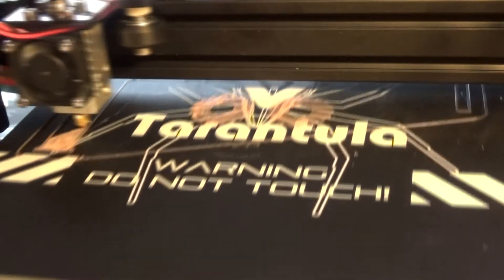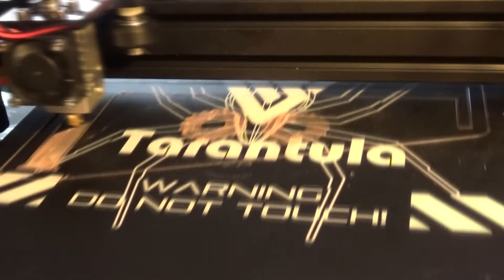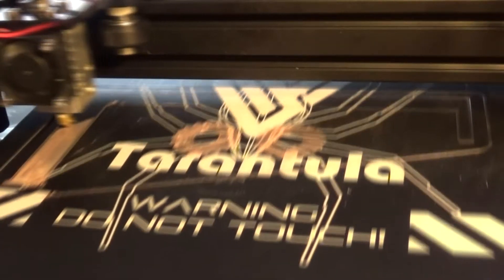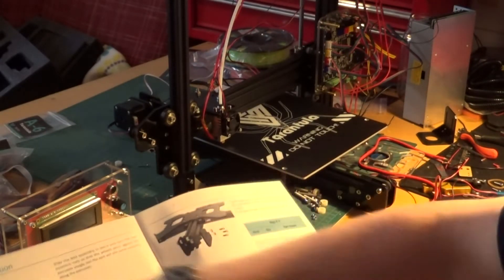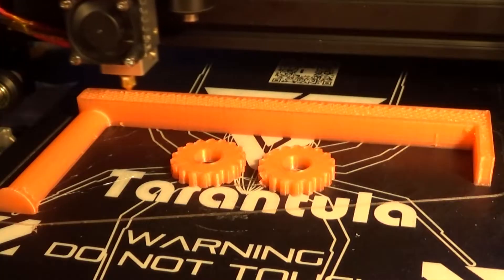The next issue is the manual. It's good for the first quarter, but then pictures go out of sync and start repeating, leaving you unsure where to mount things. If you don't have a working knowledge of building things, this is essentially a deal breaker. The instructions show you where to put the end stop switch for the Y-axis but not the X or Z. As you can see on the instructions, the Z-axis end stop position simply isn't shown. I worked out the X axis from two screw holes, but the Z mount position I'm still not entirely sure about.